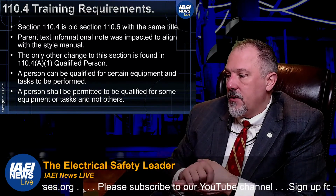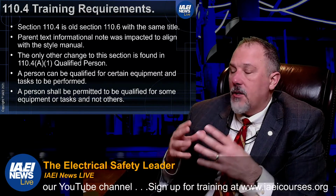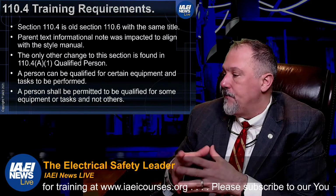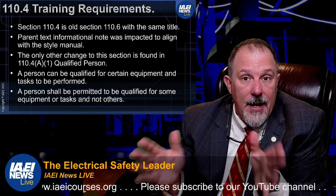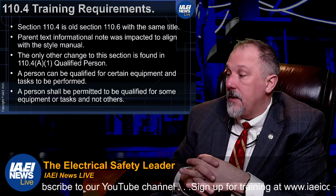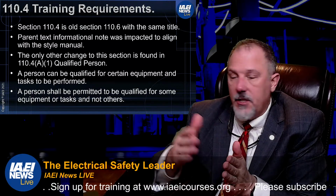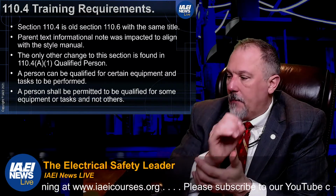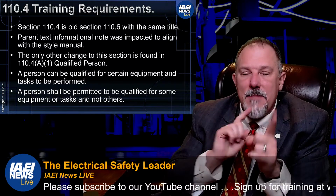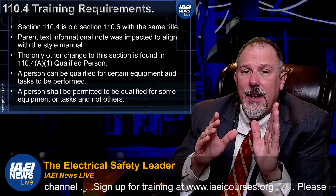So what they said was such persons shall be familiar. This is in A1, which is titled qualified person. They tell you that the qualified person has to be trained and knowledgeable in the construction and operation of equipment or a specific work method, and also has to be able to identify hazards that might be present. And it says such persons shall also be familiar with the proper use of applicable precautionary techniques, and also your insulating materials and shielding and all that good stuff. It says a person shall be qualified for certain equipment and tasks to be performed. Now, it's a minor rewording of the existing, so you have to be careful that you might not consider this new.